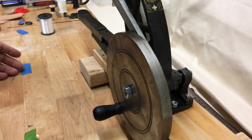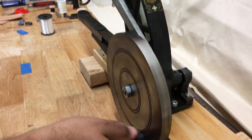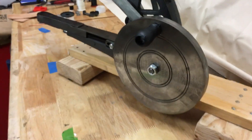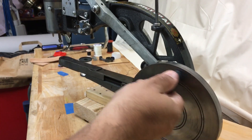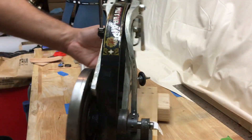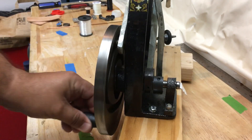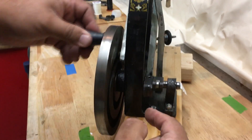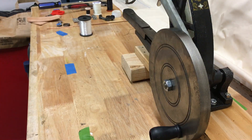Once that's on there, that's pretty much it — you've assembled your hand crank. This will allow it to move up and down. As you can hear, that sounds very good, very smooth in its operation — a nice clunk clunk as it moves. The back rotates: one side activates one lever, the other activates the lever pushing the foot the other way. In the next video I'll show some of the other aspects and the oiling points.